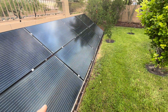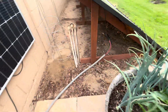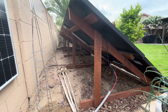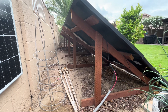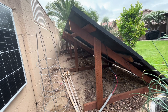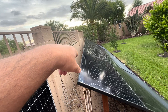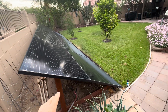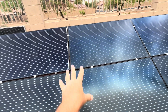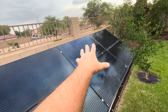The solar panels I used to have on the wall are now on this array. I built a solar array out of pressure-treated 2x4s, and it cost me about $150 for each array to hold 8 solar panels — 330-watt solar panels — including the screws. Where I'd only be able to fit 2 solar panels between each pillar before, I can now get 4 solar panels in the same amount of space at a 35-degree angle, so I went from 4 panels to 8.